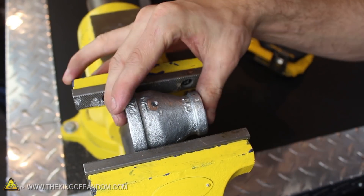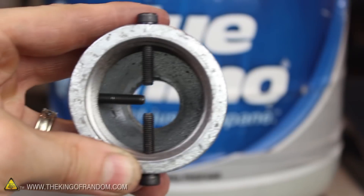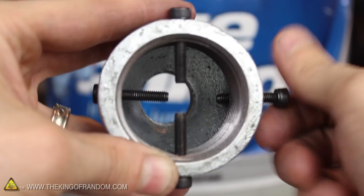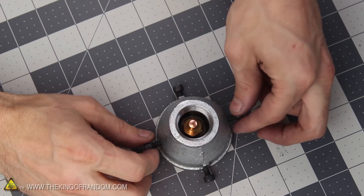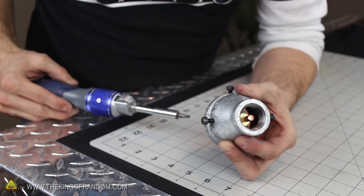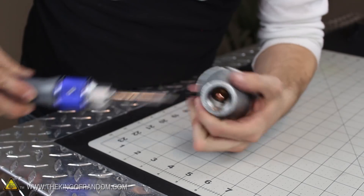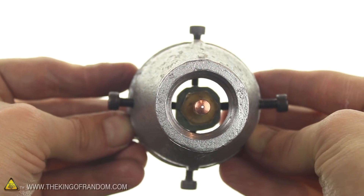Now that we've got the intake port machined and completed, the hardest part is over. We can bring back the nozzle we made earlier and secure the 2 pieces together with set screws. Twist the cap screws into the holes and you should find they easily go all the way in by hand. If you drilled and tapped your holes correctly, the 4 tips of the screws will meet together and form a cross at the center. Let's combine these 2 parts together by setting the adapter over top of the nozzle and checking to make sure the tip is centered inside the hole at the top. Secure it in position by hand tightening the screws until you feel them touch the coupling inside, then fine tune the adjustments keeping the nozzle as centered as possible. When the screws are in finger tight, we can make the assembly a little stronger by adding some tension with the screwdriver — just about a quarter twist each to lock the nozzle on tight. At this point, our modified intake adapter has 2 set screws at the bottom, 2 perpendicular screws an inch above those, and a propane nozzle sitting perfectly centered in the middle.